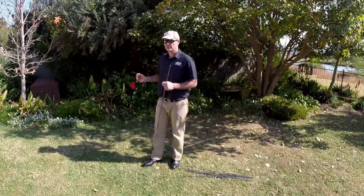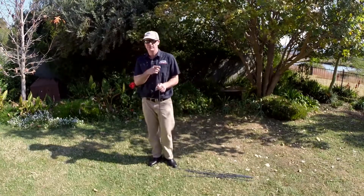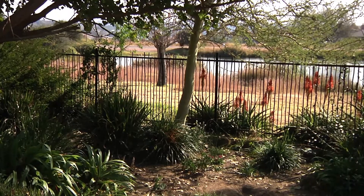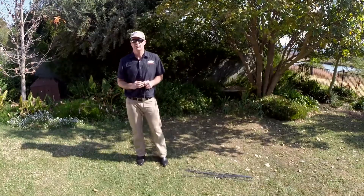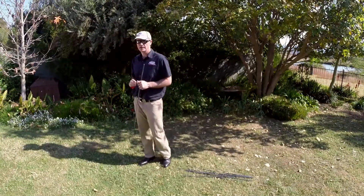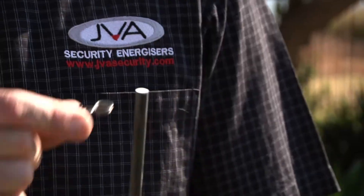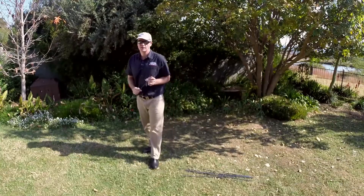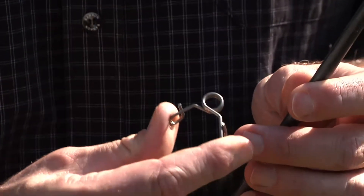In the planning phase, the house I'm at today has a filter box quite close to the area I want to secure. They have boxer dogs which are quite high, so I'm going to have my fence wires quite high on my posts. The main area of concern is the corner where the dogs are barking at people walking past. I need to stop the dogs getting into that corner. I've chosen to use the PET-100 kit as it comes because I have the mains nearby. The first thing I'll do is take out the posts and slide on the clips. As the ground is fairly moist, I can use a live-only system, and because the boxers are fairly big dogs, I'm going with three strands.